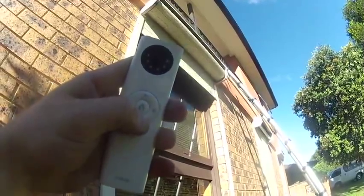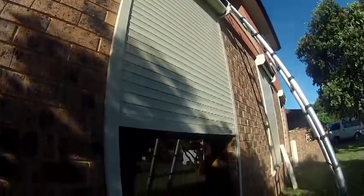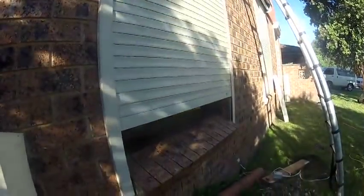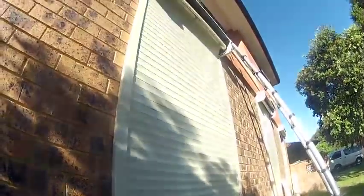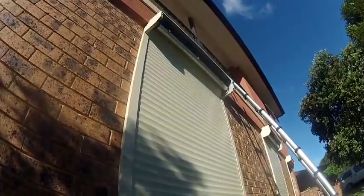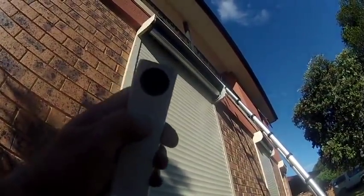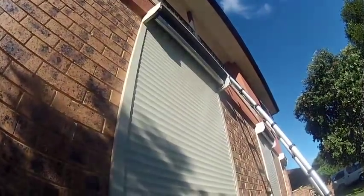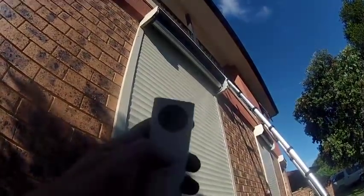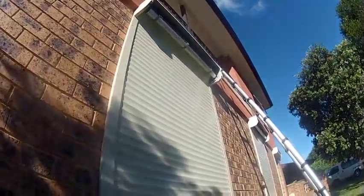You can see the direction — the first button I pressed was wrong. Down is down and up is up on this particular motor. Take it all the way down until you get all the slats nice and tight, and the springs are pushing that top slat up against the head box. Press and hold the home button — that locks both the limits and makes sure the direction is correct.